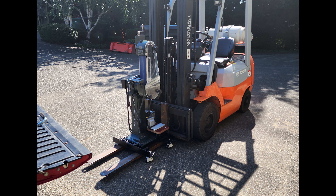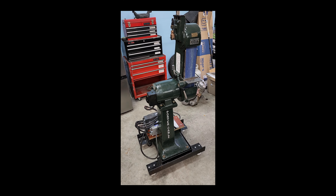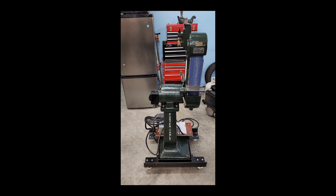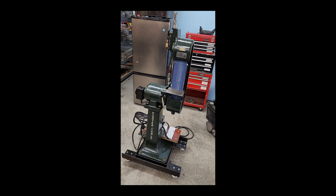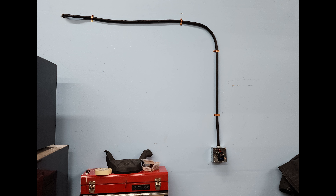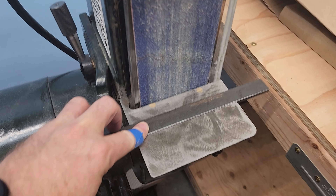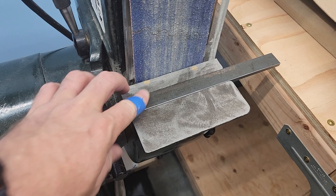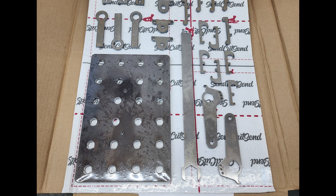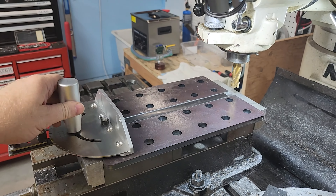In some quick shop updates: I mentioned that new belt sander. I've been looking for a high-power belt sander for a couple of years and was considering making one, but a local metalworkers mailing list had one up for sale — a tough-looking World War II era belt sander. The owner updated it with a VFD controller. This thing is cast iron, massive; we loaded it with his forklift. I wired it up with 220V and it's a beast. I love it. The belt sander had a very small working table, so I wanted to expand that and add reference holes so I could more quickly grind very accurate angles.